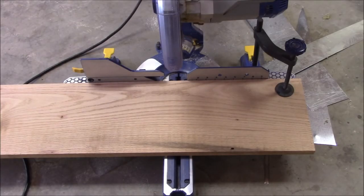Your next step is to go ahead and cut your board down to size. I'm using red oak for this project and the pattern is eleven and a half by six inches. I found a piece that was about eight inches wide and I'm going to cut it down to thirteen inches to be sure I've got plenty of room to work with.